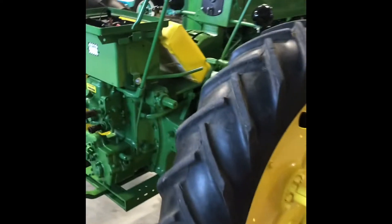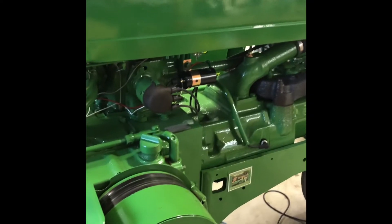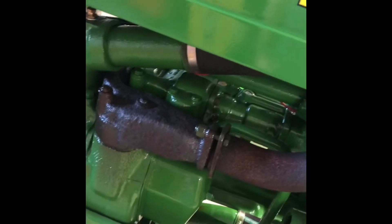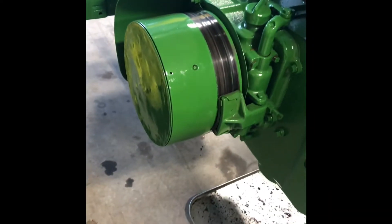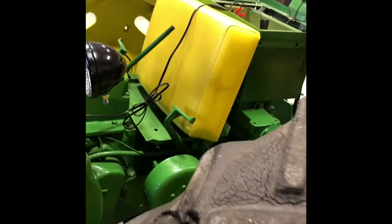The Model 60 is running pretty good. Every time I start it, it blows black soot, as you can see across the whole clear coat — this is the one I put clear coat on. The refurbished generator and carburetor have been rebuilt. It had clutch issues — figured out it was just worn springs that weren't allowing the clutch to disengage. Had it running today for a little bit, then put the battery charger on.